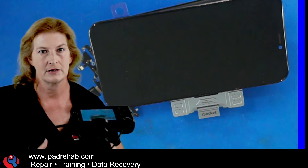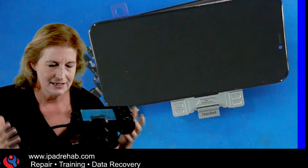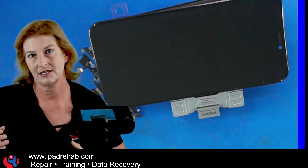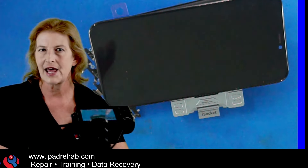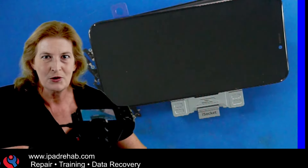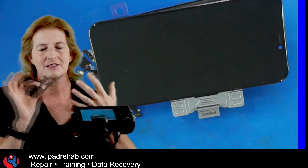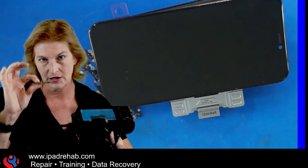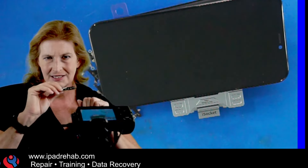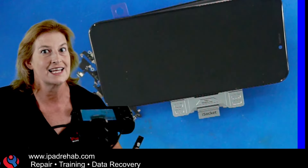Here's why this is important beyond weird edge cases. Out in the wild, people tell me they know their passcode but the phone is rejecting it. I think there must be some natural way to get into Chris's board's situation — maybe water damage, a little piece of corrosion, or some mistake inside the layers of the logic board so that the top board cannot detect its NFC even though the boards were never intentionally separated. If so, your board might behave like Chris's and say the correct code is wrong.